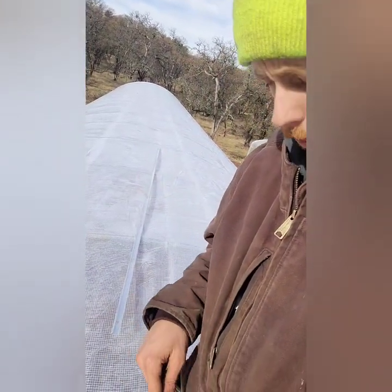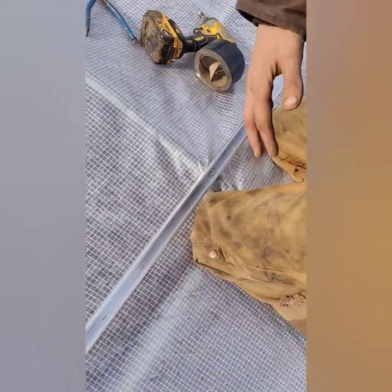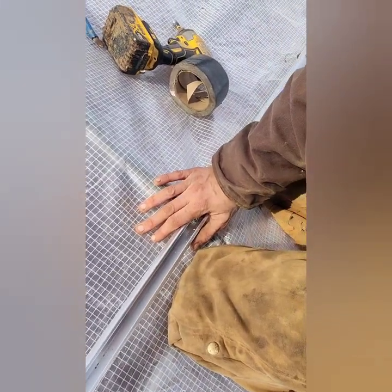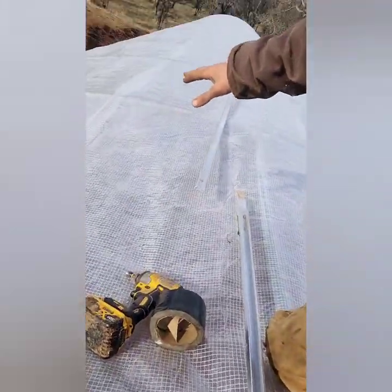You can choose to put channel on your frame in the center about two inches off your purlin. You do that so that you can actually sit your knees on something while doing channel. Without doing it this way, you find yourself stepping five-foot spaces all the way down, and it becomes a real big hassle. So put the channel on before the plastic or after the plastic.